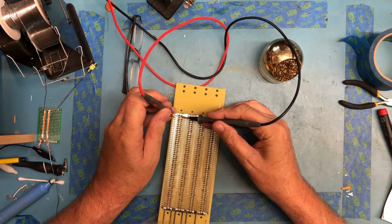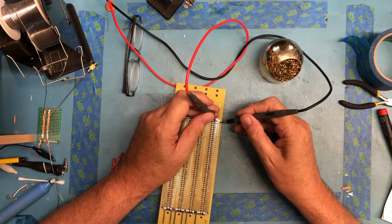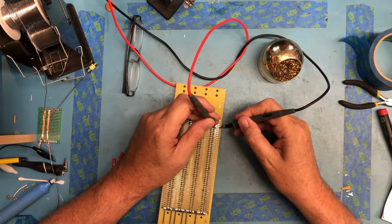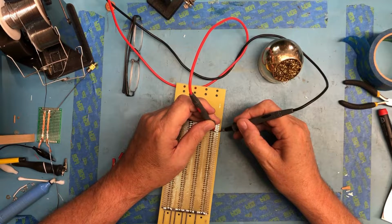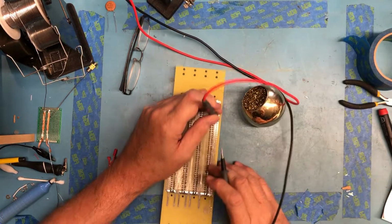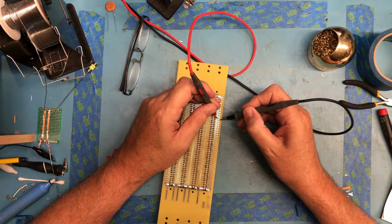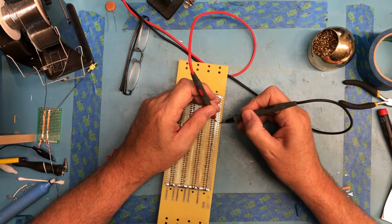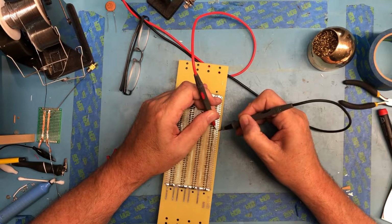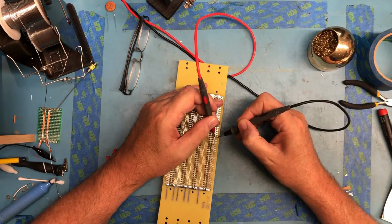Okay, what's happening is when I'm down in the hole, because they're not plated through, I'm actually not getting contact. So I need to be a little more particular about this. Just make sure I don't have any solder bridges like up to there. There's a lot of shiny traces and solder down in there, and it makes visibility a little bit rough, and it's better to be safe than sorry. I'd hate to spend hours trying to get a CPU card debugged and discover it's a solder bridge on the backplane. That would be difficult.